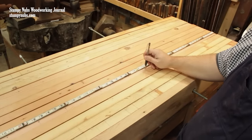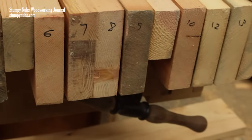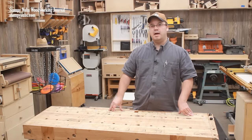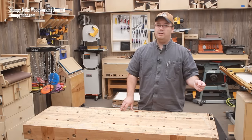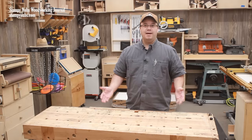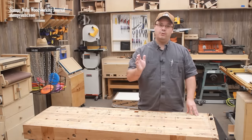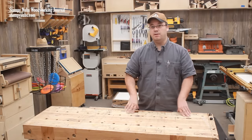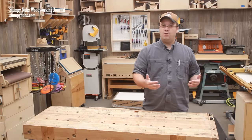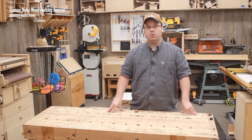This one cost nearly nothing because I used salvaged boards from old construction. Using old lumber also meant the wood was dry. If I bought brand new 2x6 lumber from the home center, I might have had a twist in the frame by now as it's dried and moved over time. If you only have access to new lumber, I'd suggest letting it sit in your shop for a few months to acclimate. I recommend buying 2x10s or 2x12s and then ripping them down into 2x6s, maybe even removing the pith in the center of the board, because this wider construction material often sits around a lot longer than the 2x6s, which are just pumped out in vast quantities for building projects.